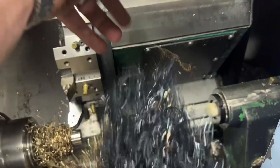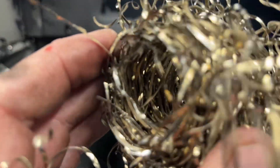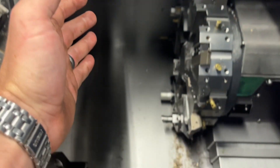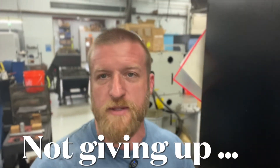We got some gnarly looking chips — take a look at this wicked bird's nest right here. Whoa, what a beauty. Let's try again. So the first two trials, as you can see, did not work. We did not get it hot enough — we got a lot of chip breakage. I mean, we were really cooking and cruising, but it didn't work. So now we're going to go back to basics. I'm going to bring in some 17-4 stainless, same WNMG 432, and rip it at about a thousand surface footage per minute — kick those parameters into high gear and let's see what we can do.